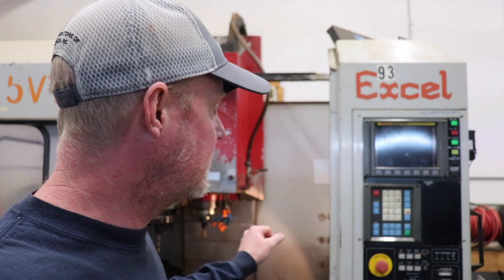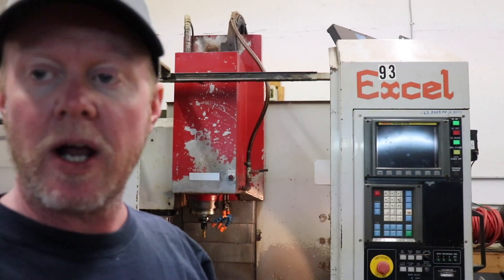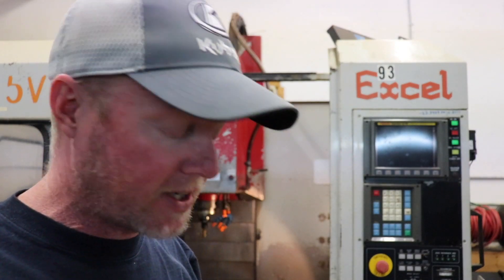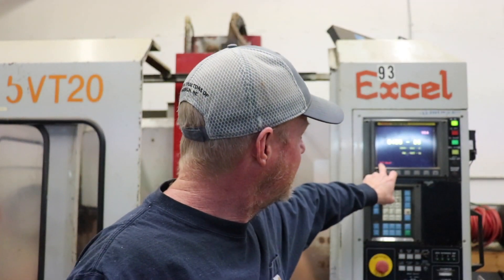So I've got my rotary phase converter turned on, the machine's turned on, I've got air. You need to do all of those things — make sure you've got air, make sure all your power rails are correct. What's going to happen is I'm going to turn the machine on and we're going to kind of simulate, because it does come up in the not ready anyway. I wouldn't normally be able to hit the ready switch and have it turn on if you exhibit this problem. So if all else fails, this is what you need to check to get your machine back running. We're turning on the control now — it's going to boot.